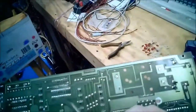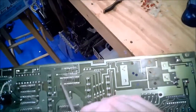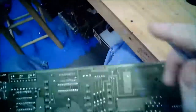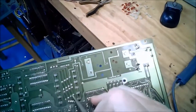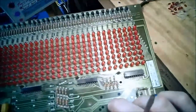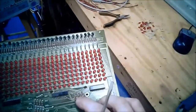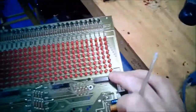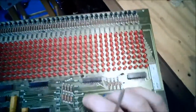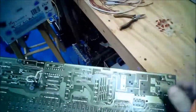So now the back side of this chip. So there you got two sets of inputs. They wrap around and come up here, which hooks into the bus for these chips. And then you got these sets of four inputs here, which wrap around to this cluster here. We haven't looked at these, but this set here and this set here look to be terminator resistors for this long bus feeding all these 273s. So we'll have to sit down and beep that out next. But for all practical purposes, this chip here is just redriving that bus.